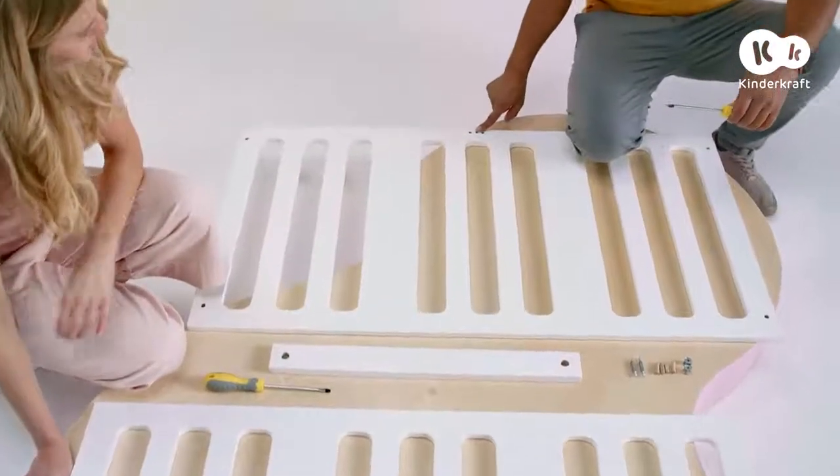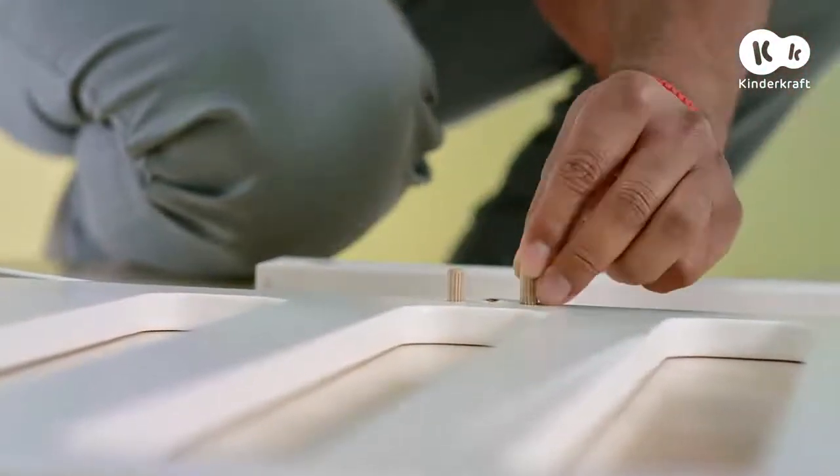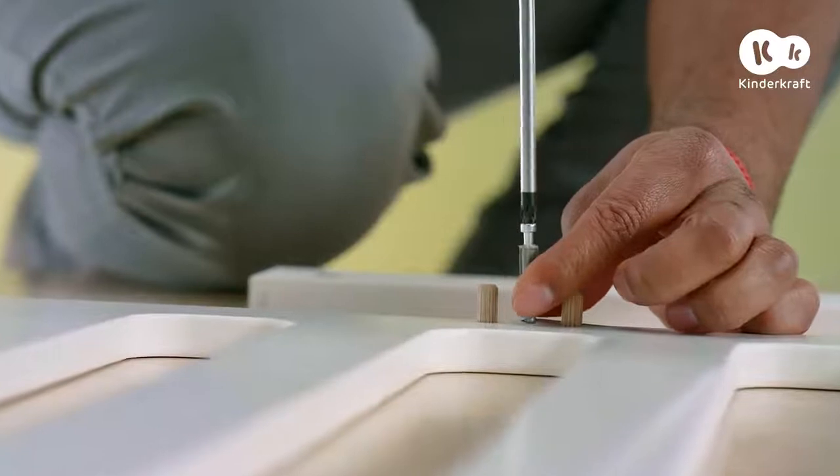In the middle of the wall there are three openings. Place the pegs in the external ones and screw the eccentric pin into the middle one. Do the same on the other wall.